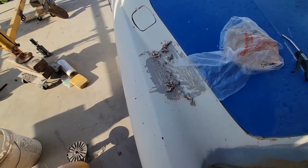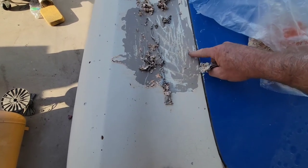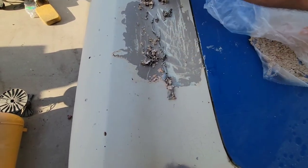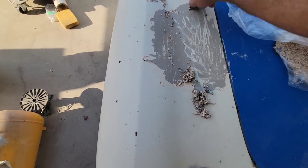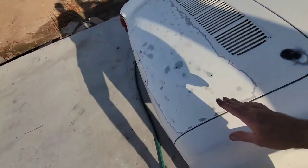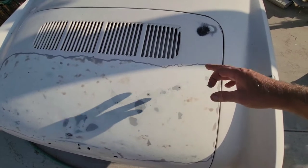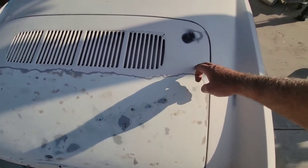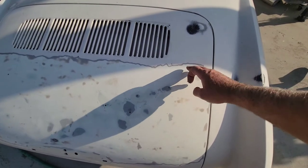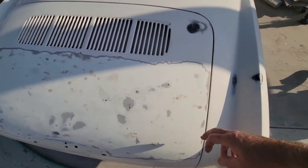But with the plastic left on it, it actually took it off just about as much as I wanted. From here, this stuff sands off pretty easy, so I could rinse it off with water, get all the stripper out of it, and then just finish sanding it. Comparing to the area I did with the spray can stripper from Goof Off — that took off this layer but wouldn't really get into the sealer at all. Then when I stripped off some of the sealer and tried a second coat, it went right through the sealer and into the original paint underneath, which is not what I wanted.